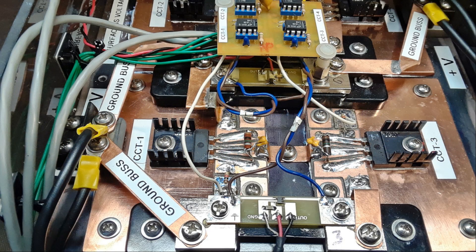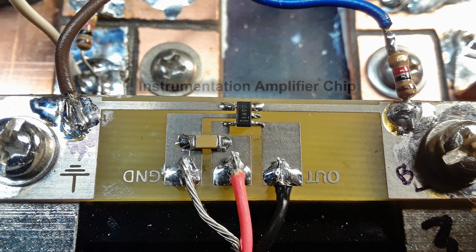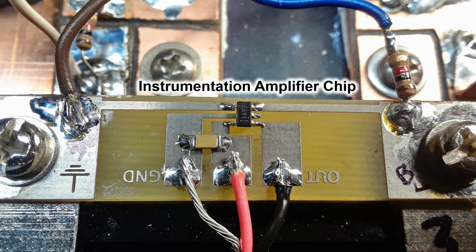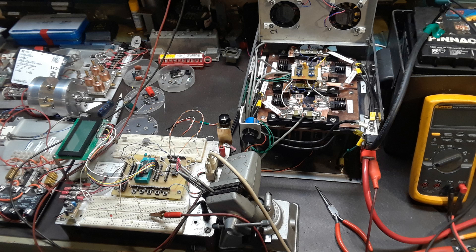The main function of the DC load works very well now, so it's on to the next part: the instrumentation. Getting some kind of display on it to show the actual current and voltage and whatever else we can program into it. I wanted a digital display on the front of the machine to show the applied voltage and the total current. Each of the four MOSFET circuits has a shunt which will give me 75 millivolts for 50 amps flowing through. The little circuit boards I built earlier bolt right across the shunt itself, and on there is a small instrumentation amplifier which comes in different amplification factors: times 50, times 100, times 200, etc. I built up a test circuit using one of my PIC evaluation boards and had the four shunt amplifier signals going into four of the analog inputs of the PIC. With the right code the display shows me the four separate current signals from each MOSFET, the total current, the power dissipation, the applied voltage, and other goodies.